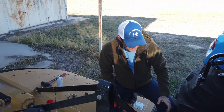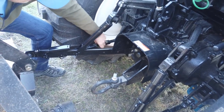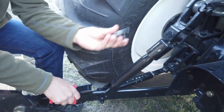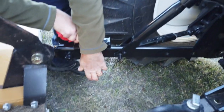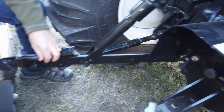We need to be able to swing our lift arms side to side. All the LS tractors come with these telescopic stabilizers — no more rusty turnbuckles with lock nuts. These pins will snap your fingers really good so we're gonna watch that. There's a handy little holder so you don't lose track of it. Now we can swing these side to side.